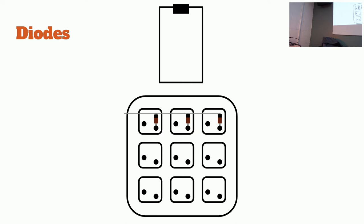Cool. So the loop is really just, it might help if you can close it up a little bit more, but it's really just so that you can get a solid connection in there. Let's try this. We can actually pull this. There you go. So that's a pretty good loop. And that's pretty tight, and so now when you apply solder in there, through capillary action, it's just going to fill right in, right? Nice.